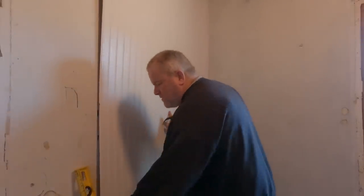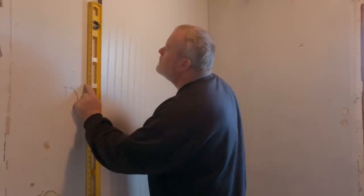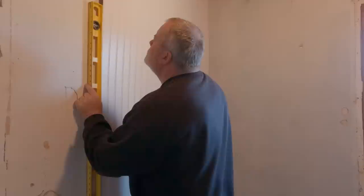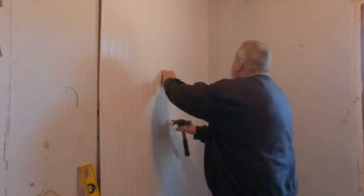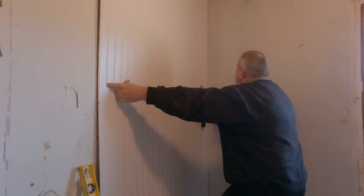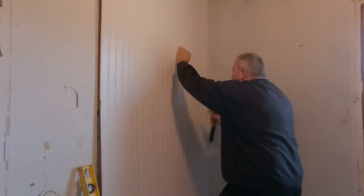All right, let's just get a quick level check, see where we're at. Yeah, that's pretty good. I've got my reading glasses. Let's see. Yeah, the bottom can't go in anymore, so ain't nothing I can do about that. All right. I hope the guy has the studs at 16 on center. That's about where we need to be. Now it should be center. I'm just going to tack a few in. Let me tack one in right here, just see if this has a stud.